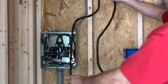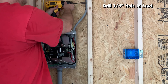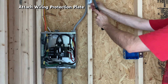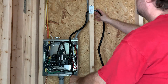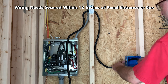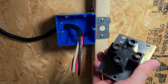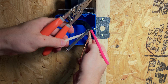This is the 100 amp electrical subpanel in my garage — roughly where the wire will be going. I need to drill a 3/4 inch hole in the stud, attach the wiring protection plate, and thread the wire through the hole. I make sure I leave enough wire inside the electrical panel box and enough to reach the outlet box. I also need to drill a little more in the middle of my garage. Strip about 6 inches of the outer wire jacket to reveal the four individual wires, then remove the paper surrounding the ground wire.